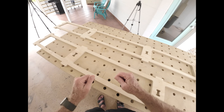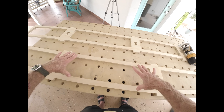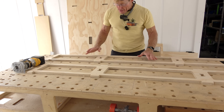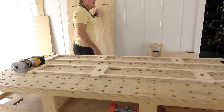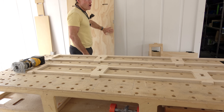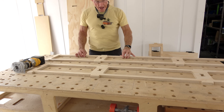For the sides and the spreaders, I'm going to do the round over or the bevel on the inside and the outside of the openings. I won't be doing the outside edge where it assembles or where it goes together, and the same with the top and the bottom — I'm not going to pre-edge those. The insides don't need to be done at all; it'll just be the outside, and when it's all put together I'll run the router around and do that.